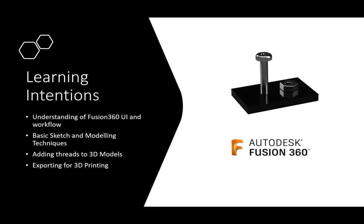Now, the particular screw that we're looking at there is an M3 screw. That means that it will go through a 3mm hole, and that is too small for us to be able to print. Typically, if we are 3D printing screw threads, we go for an M8, an M10, or an M12.